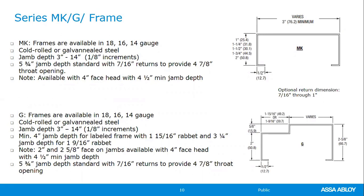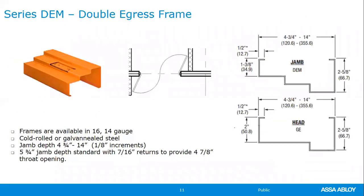The M-K frame is the cased opening, or trimmed opening frame, available in 18- to 14-gauge galvanized and cold-rolled. The G frame is the single-rabbet masonry frame, from 3-inch to 14-inch in one-eighth-inch increments. Be aware that around 4¾ to 4½-inch jamb depth, the frame will only be single-rabbet because the manufacturer cannot form a double-rabbet at that size. The DEM series is the double egress frame, available in 16- and 14-gauge, fire-rated from one-and-a-half to three-hour, with surface or concealed vertical rod preps available.